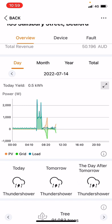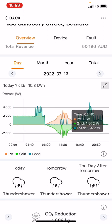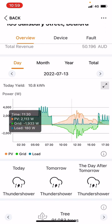Under the day view there's a back arrow, so I'll go back a day. This gives a nice illustration of what's happening. You can see this house is consuming loads of power at night and in the morning — taking two kilowatts from the grid — and then as the sun comes up and the solar starts, they're turning everything off. This is a good illustration of what not to do with solar. Ideally you want to run high-consumption items during the period when the solar is working, so the solar covers that power for free. I'd encourage this house to run the air conditioner during the day to get the house warm, then turn it off when they come home instead of turning it on in the evening at full cost.